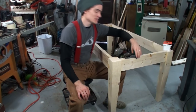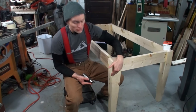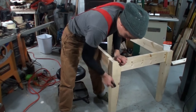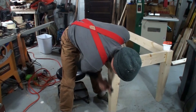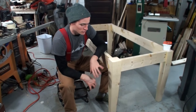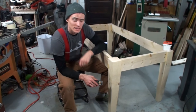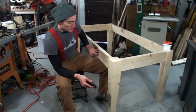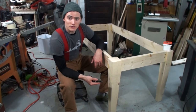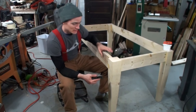The other thing that I do — and I've already done this; it's easiest to do before you even assemble the table but you don't have to — is I'll go over all the corners of the legs with my hand plane and just knock off that sharp edge. It can be freehand, you don't have to be real careful with it. Sometimes when things are a little more wonky it kind of looks nice on this style of table. I also want to add a little bit of texture to the side of the apron boards. It's not going to exactly look like a rough sawn board but it's going to give it some sort of texture that will kind of connect in people's heads.